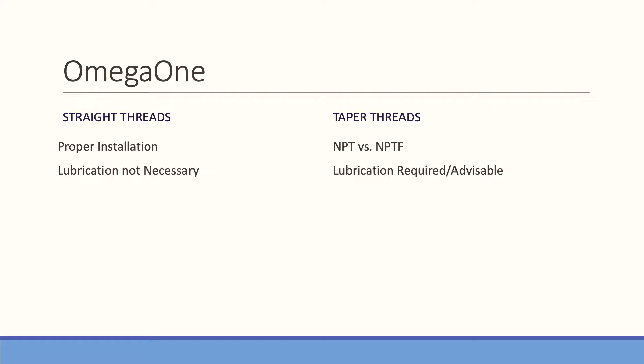As with any type of fitting style, not over-torquing it and handling the threads with care, following the specifications in J514 about how to handle the fittings, is important. When you do lubricate fittings, parallel threads can, per J514, use a lightweight oil to lubricate them. It's always important that you lubricate the fitting with an oil that's compatible with the fluid in the system and an oil that will not damage an O-ring if there's an O-ring involved.